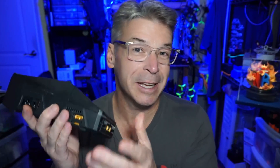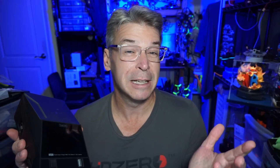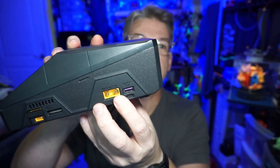I don't trust myself with those boards, so I don't even have a sample here to show you. If you're new to FPV, we have these parallel charging boards where you take a single port and turn it into a port where you can charge multiple batteries — it acts like one big battery. The problem is if you plug in three batteries and one is discharged way too low, it throws the voltage off. The charger only sees the overall voltage, so one weak battery can get way overcharged and let out the magic smoke.